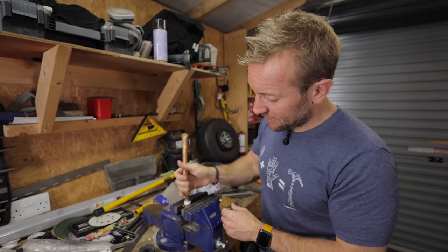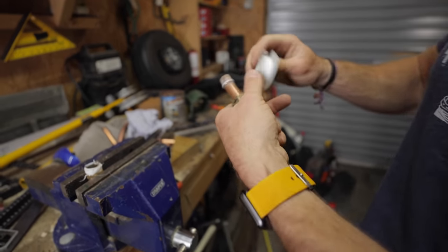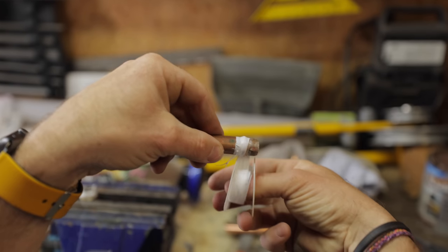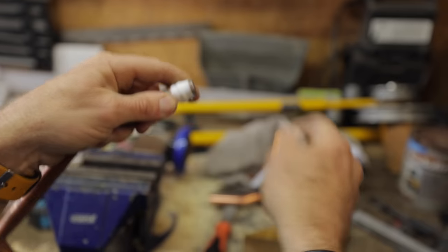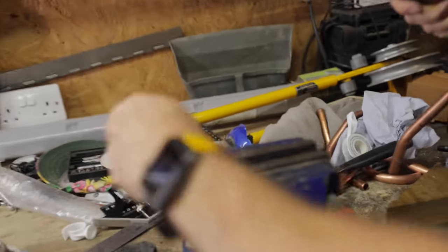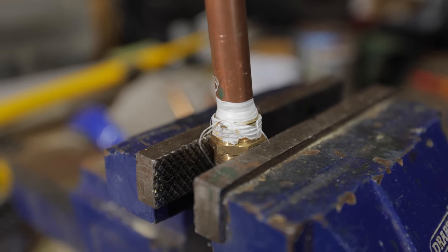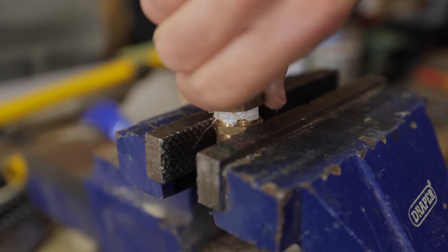If you really want to fix this, you'd pull that out and move the pipe so you can get the olive clear. Then get your PTFE, roll it off the back, pop it on the pipe around the olive like that, just a few rolls — you don't need loads. Give it a little run with your finger to make sure it's nicely seated. Then pop it back in. Look at that — that would make a watertight seal once you tighten this up. I wouldn't say it's a permanent fix, although I have seen these last 20-plus years, but it would get you out of a bind if you couldn't get your plumber out in time.